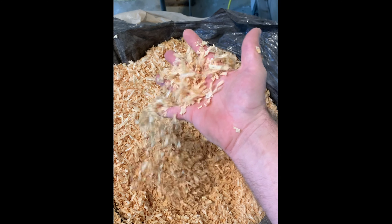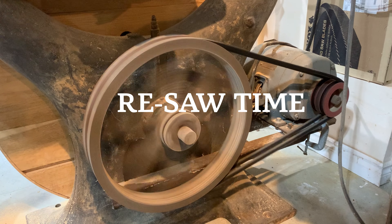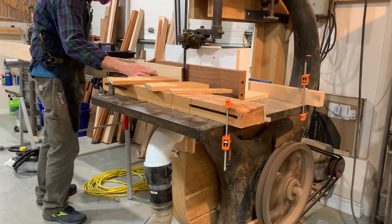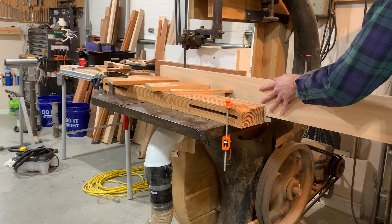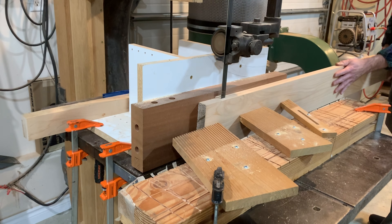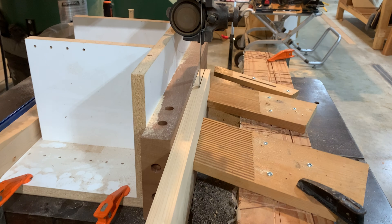In order to get a nice resaw, you want to make sure the outsides are square and flat first before you go to put them against the fence — that'll just make everything nice. Nice sharp blades on the bandsaw and on the planer really help. I just used some simple featherboards I made, screwed them to that piece of wood that's clamped to the table of the bandsaw, and I have a bit of a tall fence that I made for other things that I kind of repurpose as needed. And this went about as smooth as could be.